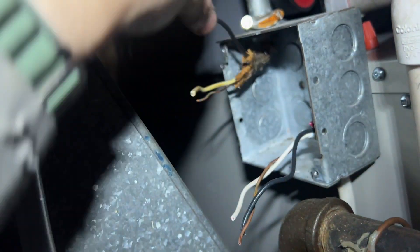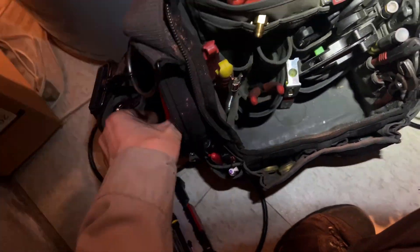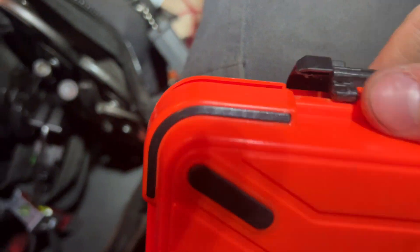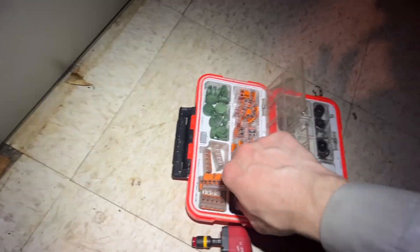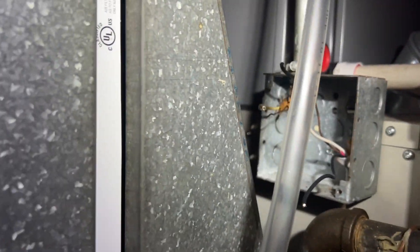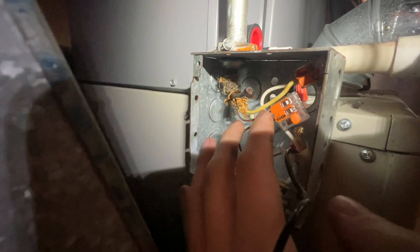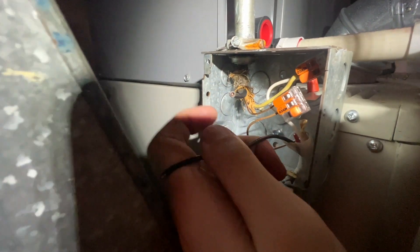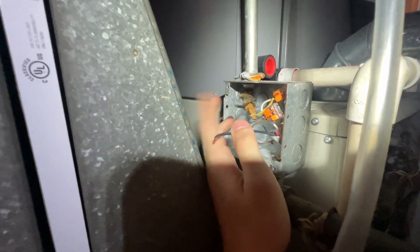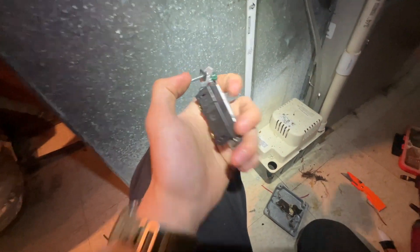Just a little bit more room to work with. For our grounds and our neutrals we will be using some Wago lever connectors. Our ground is going to have a three-wire connector, our neutrals get a two-wire. I'll strip those back and connect. Three-wire on the ground because I'm going to run a ground to the switch itself, and two-wire for my two neutrals. The power comes in on the line, and the load will be broken by the switch. I'll strip these with a little hook and run into the screws, make them nice and tight.